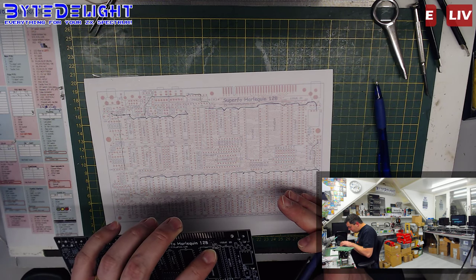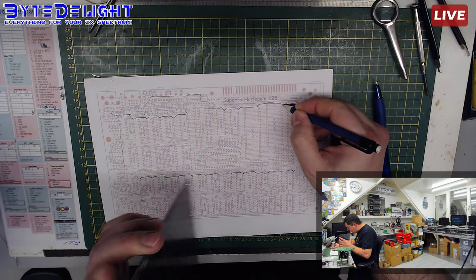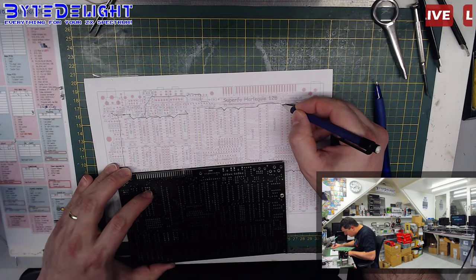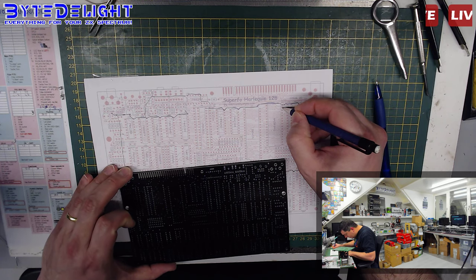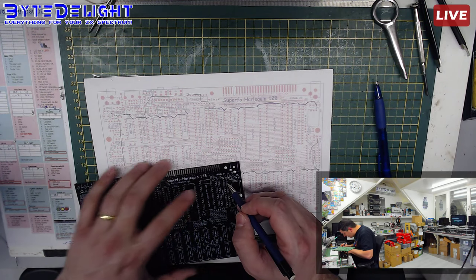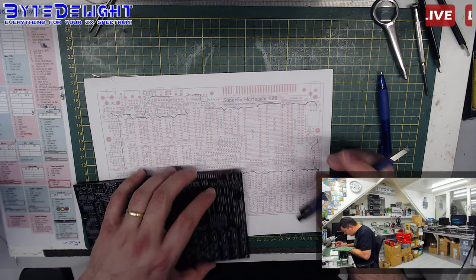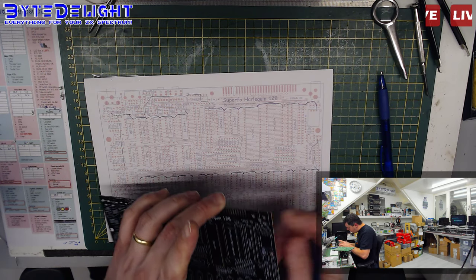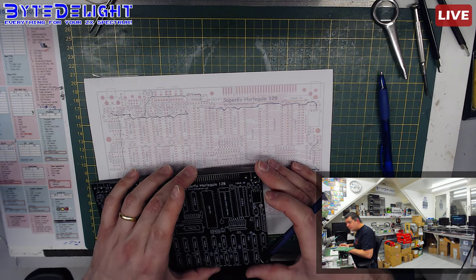All right, so from that pin here, I think there's a track going down. Let me double check. Yeah, this one goes to here. Not on the other chip, only this one. Is there a track going from there anywhere else then? Yeah, to the inside. No, I'm wrong again. Let me check. So it's this track that's connected to nothing, only that pin. Okay, it's just a connection between two pins, nothing strange there.